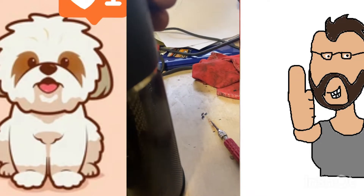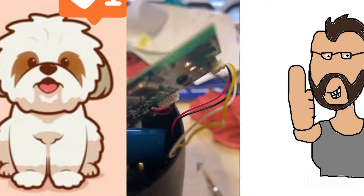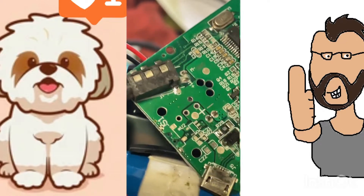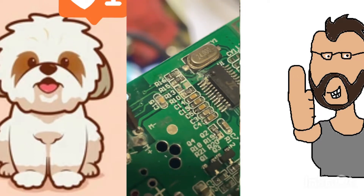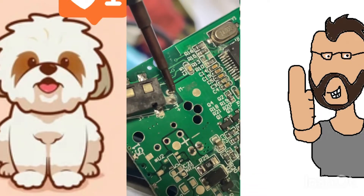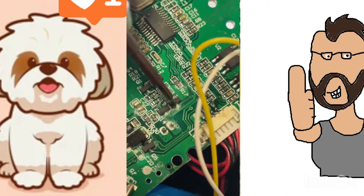What I can see right here — there's no solder on that piece. That's a bullseye right there. See how it's clearly soldered on the other points, with the obvious silver solder, and this one isn't? Looks like this component fried — that could have been a previous problem. See how on all these other points the solder is so obvious and silver? And I can see a little corrosion right there too — we'll clean that up.